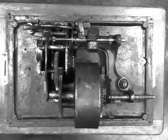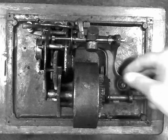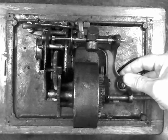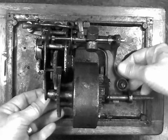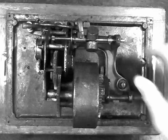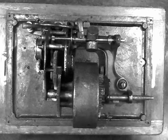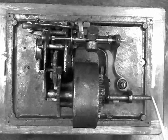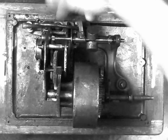So we just lift up on the bed plate, turn it over, and put it back into the cabinet. And there's our motor. The motor is mounted on springs. This is the Edison B — on the Edison A it is not mounted on springs, it's screwed directly to the bed plate. The whole idea of the spring mounting was to provide some shock resistance and to cut down on vibration and resonating noise. So we've turned the bed plate over. This is our motor, and there are three screws with two springs — a spring on the top and a spring on the bottom in most cases.